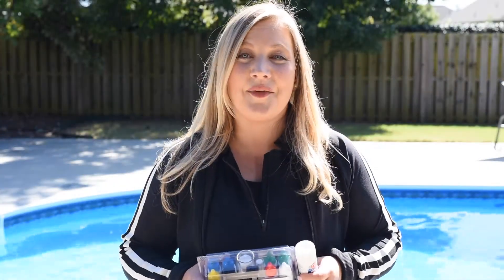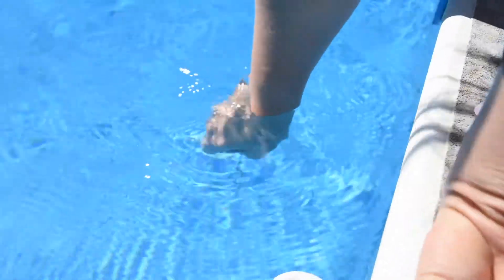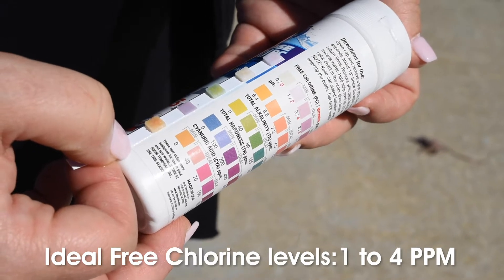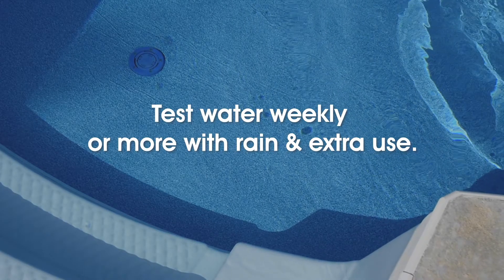You asked: what should the chlorine level be in a swimming pool? If you're DIYing pool care, it's one of the most important values to understand, and your test strips and test kit can help. When we talk about the ideal chlorine level for safe swimming conditions, we're actually talking about the free available chlorine, not the total chlorine in your pool. Free chlorine is one of the values measured by your test strips, so it's easy to track. You always want your free available chlorine levels to stay between one and four parts per million for ideal swimming conditions.